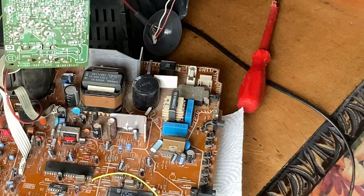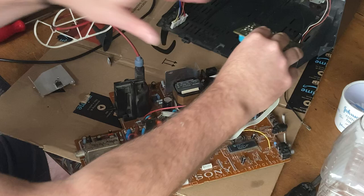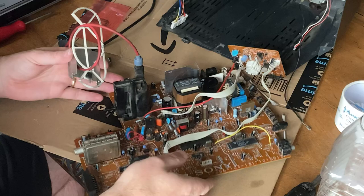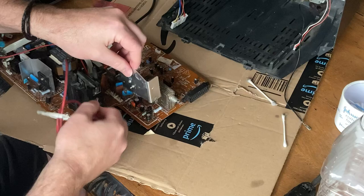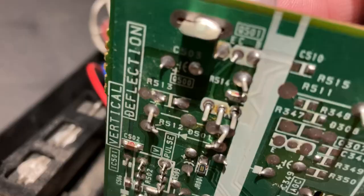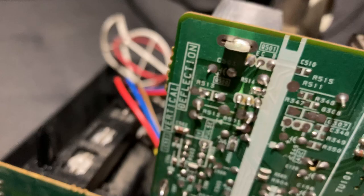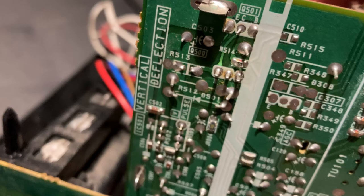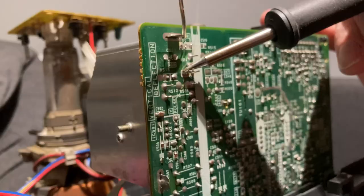Once the board is clean you can start looking for faults. We know there's a voltage or power issue — something not getting to the screen, either the vertical sync, horizontal sync, or similar. Most likely it's the vertical sync, as I know in hindsight that's what the problem was. My first port of call was to go through the board and look for leakage on the capacitors — none of them were popped, bulged, or showing electrolyte leakage.